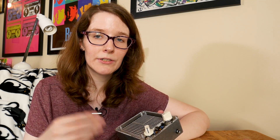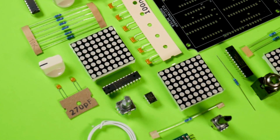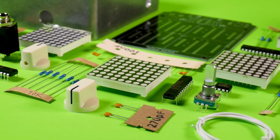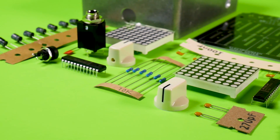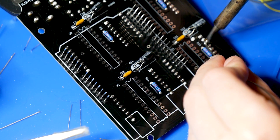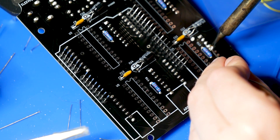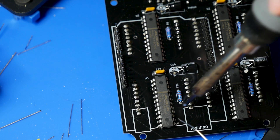This does come as a kit — you assemble it up. I hold ElectroSmash in pretty high regard as far as their instructions go. They have great pictures, label their components beautifully, and everything comes together nicely. This one is no exception. Because of the layout of the PCB and the matrices, you do have to pay attention to the order of the steps. If you do that, you'll be totally fine. However, I got a little distracted making sure the pins were straight on the LED matrices and soldered them up a step early, so I wasn't able to solder in the Max 7219 ICs as through-hole components. I ended up soldering them in surface-mount style, going along the sides of the pins, and it worked out fine.